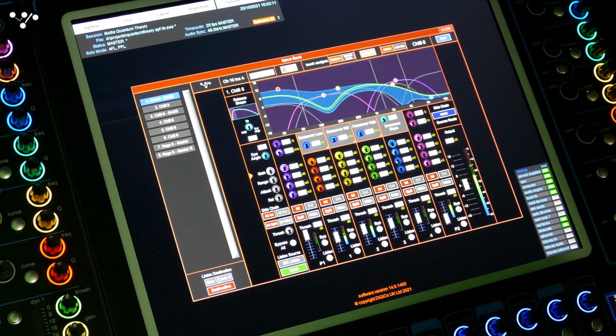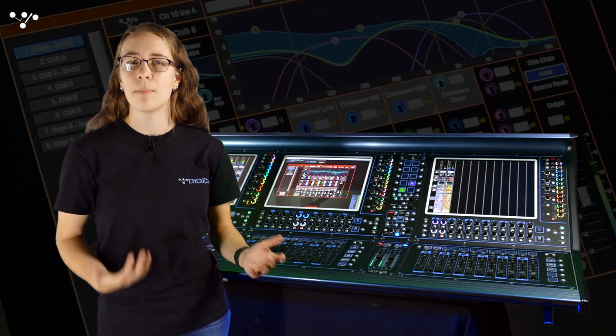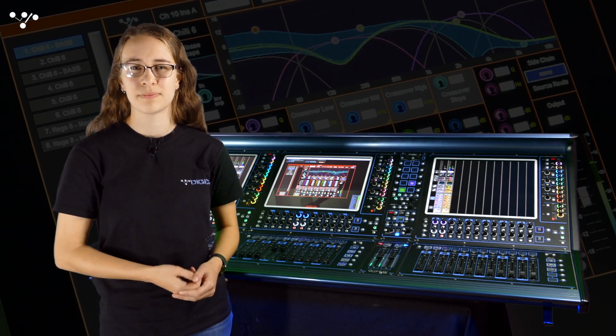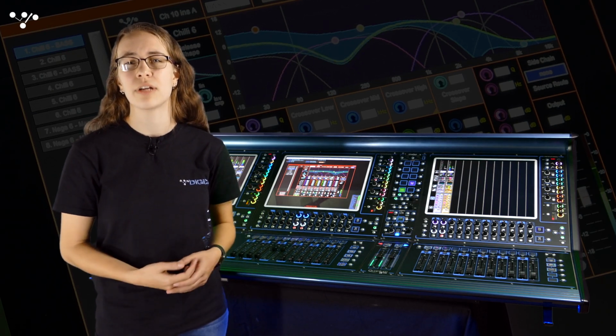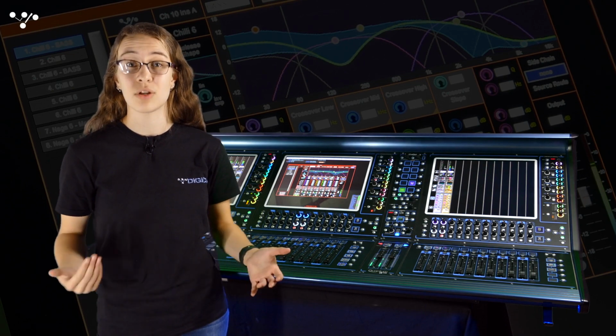Gain is used to set the starting EQ curve that's applied to the signal before it reaches the threshold. Range is the maximum EQ change after the threshold is exceeded. This can be a positive or a negative change. By using a range control instead of a ratio, we have a much more precise control over the maximum EQ change achievable. Unexpected extreme dynamics, which can often occur in live scenarios, could cause massive and undesirable EQ changes if there was no range control.